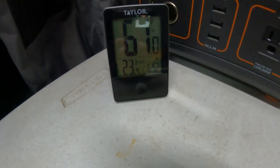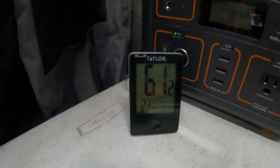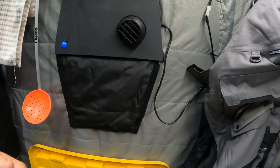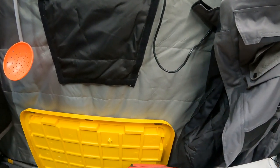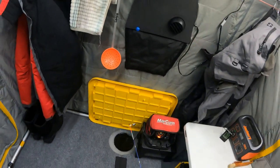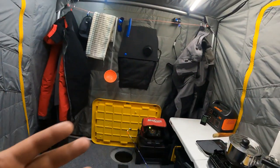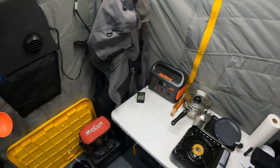Time check at 6:52: outside temperature is 23.4°F, inside is at 61.2°F — still running at the mid setting. You can probably hear a little bit of the fan blowing, but I hear absolutely no ticking of that dosing pump — I can't hear it at all, which is fantastic. Another cool benefit: it's been running for a while and inside there's absolutely no condensation, no moisture. That nice warm, dry air coming in is fantastic.